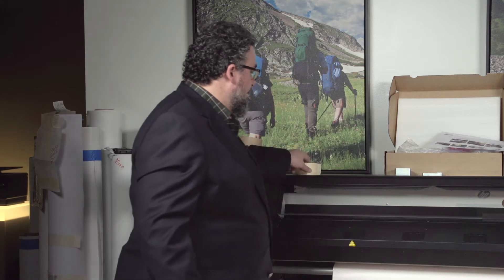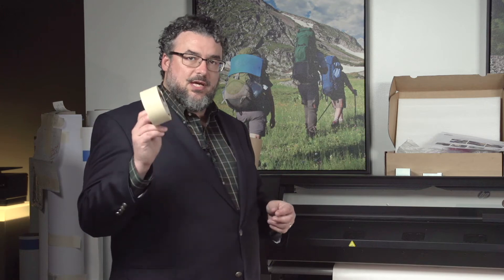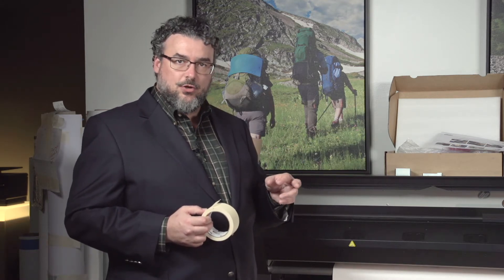When I put media on a take-up roll, I use three pieces of two-inch tape. I start in the middle, put it on each end, secure it to the core, then roll it down, take it up a little bit, get some tension, slide the dancer bar in, and I'm good to go. I don't use smaller tape because it doesn't immobilize the media as well — the one-inch can still turn a little bit. I want it on there perfectly.